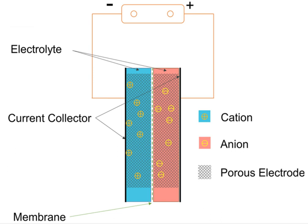Device properties can also be seen to be dependent on device temperature. As the temperature of the device changes either through operation or varying ambient temperature, the internal properties such as capacitance and resistance will vary as well. Device capacitance is seen to increase as the operating temperature increases.